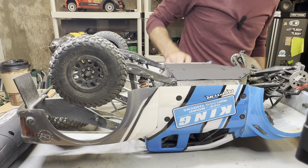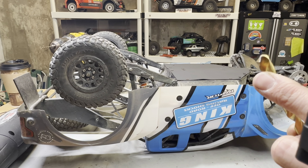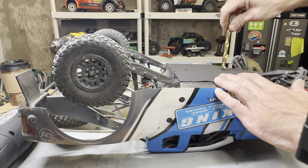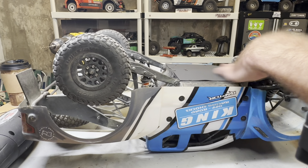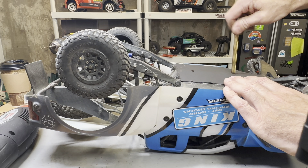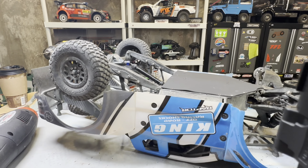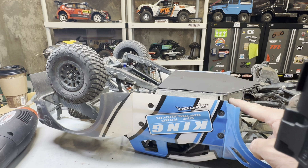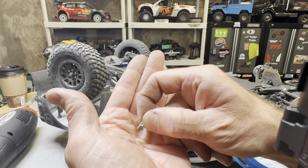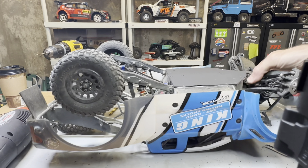Using a very large, roughly 3/8-inch bit by hand to countersink the larger screw holes — the tip shape matches the screw head well. Taking out just enough for the screw head to sit flush. For the front plastic plate screws that were stripped out, going with a slightly longer 10mm screw — stock were probably 6 or 7mm — just to get better grip.